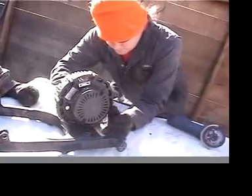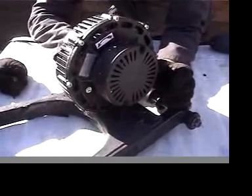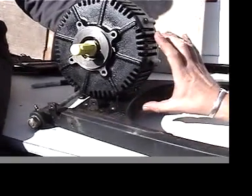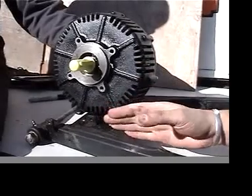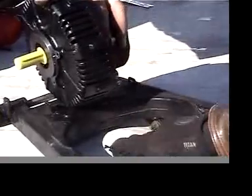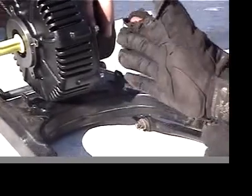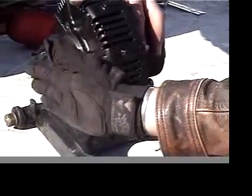Now comes the tricky part. There's not a lot of space left for the motor to fit, so it's going to be a tight squeeze. Once we cut away some of the metal from the swing arm and lower the motor into it, we're then going to mount a piece of plate steel here with a couple of holes through it so that we can bolt the motor right to it — that's essentially going to be our motor mount. The important principle is that this spindle is perfectly in line with the sprocket on the back wheel, and that they're both perfectly aligned both ways.